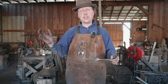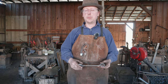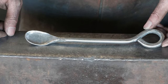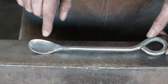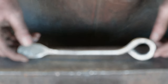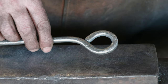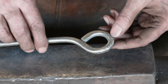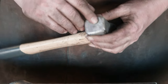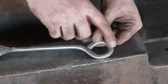Let's take a final look at this spoon. Since our last video, I have actually become a Level 1 Abana certified instructor. So let me give it a look with that instructor's eye and whether or not I would pass this spoon. Overall, you know, it looks pretty good. As we look at the front side of it — I wasn't able to get in there and clean all that crud out with the wire wheel, but that is not part of the consideration. This looks pretty good; it's reasonably free of hammer blows. As we flip it over, we do see a couple blows right in there and a few more here. Because we didn't bend in quite the right spot initially, we had to take it longer — that's where those hammer blows are coming from. I've recently started playing around with this new-to-me Swedish hammer, and I think I need to round these corners off a little bit more — some of them are pretty sharp still, and that is contributing to these hammer blows.